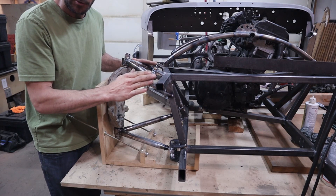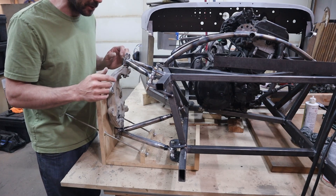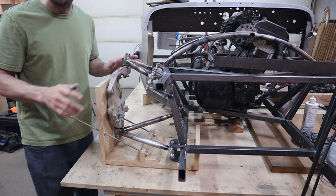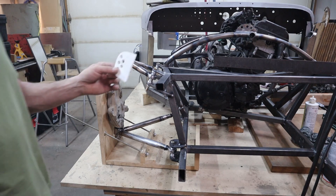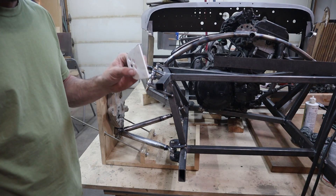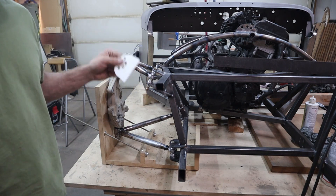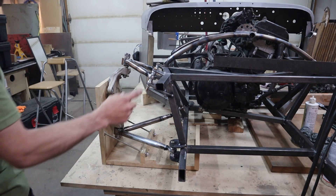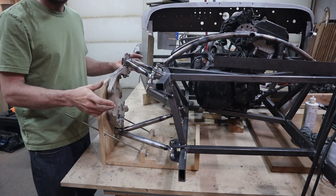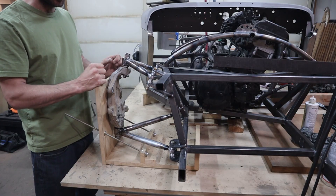I had to get the tabs made more than once, so by the time I was all done there was just too much filming to do, so I went ahead and tacked them all in place. I made all my templates with just some 3/16 foam board — works really nice when you're using 3/16 plate. It lets you know exactly what you got, and when they're taped in place you can actually bolt everything together and they will hold it enough that you can tack in your arms.